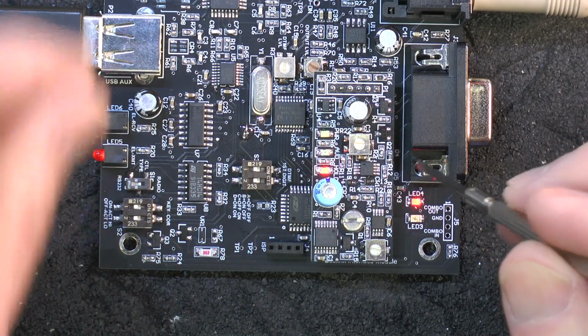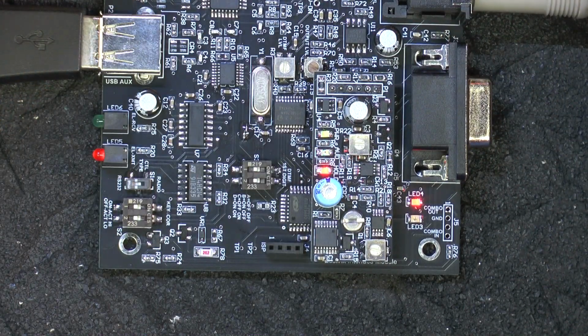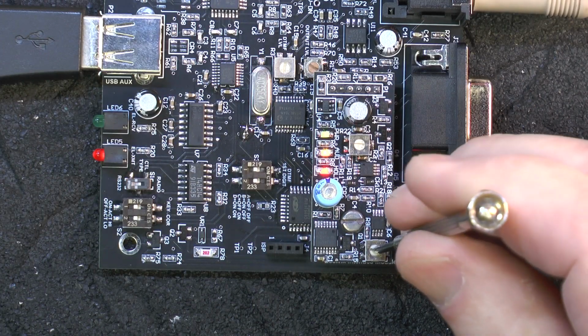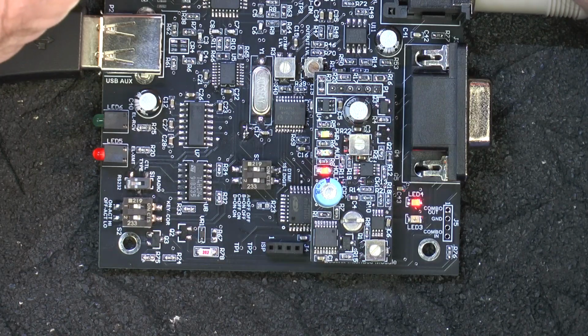So I'll remove audio here. So see, it comes up right away. And it holds. So if you remove talking, it removes pretty quickly. But there's a lot more level here, or timing here. If you bring this all the way up and I remove the audio, it'll hold for quite a while. See, I think it's around 3 seconds or so. It might be a little shorter than that. 2.5, I'd say. About 2.5 seconds maximum between voice peaks.